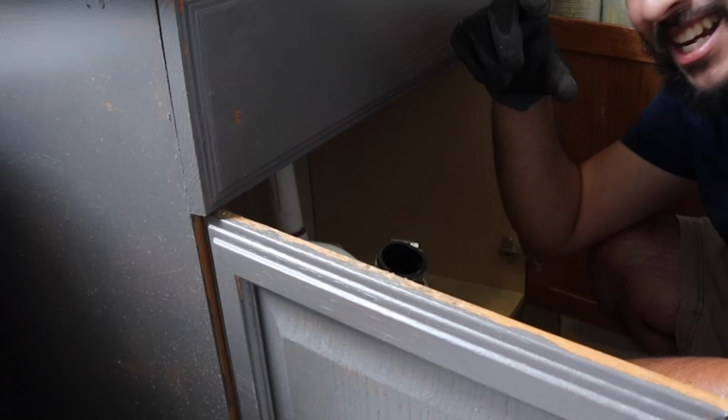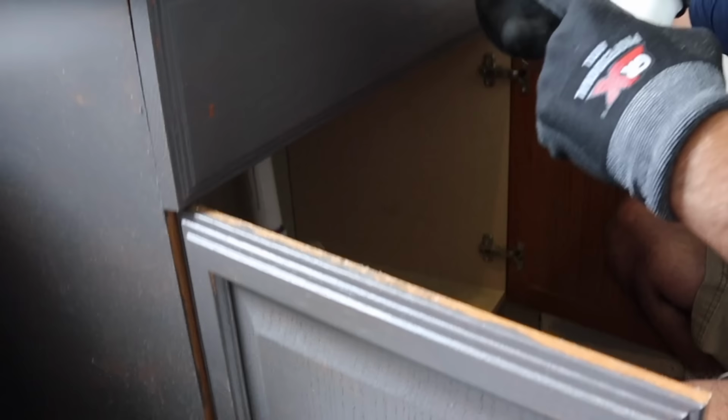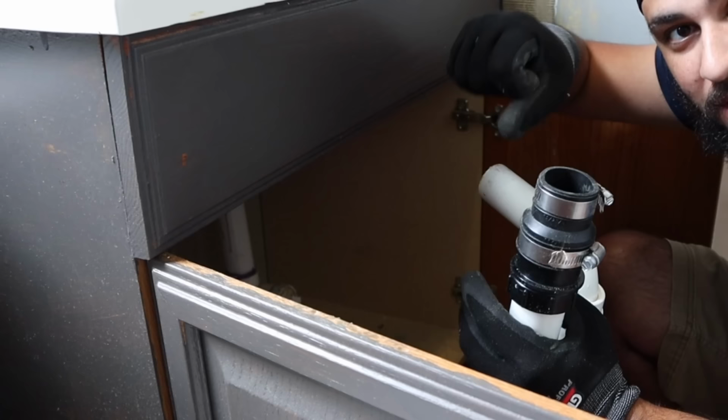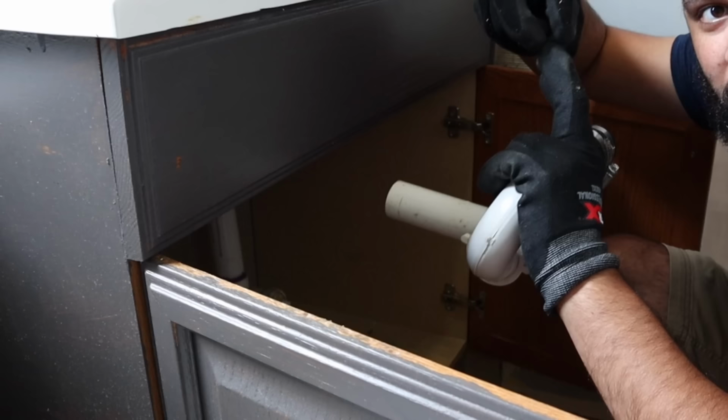You take the pipe that's split, and you take a pair of cutters and you cut that part off that's broken. Then you take that SharkBite and you slide it on both ends and you twist it. And the reason they call it SharkBite is when you twist it, these little spike things come out inside and they grip onto the pipe. It was a quick fix.